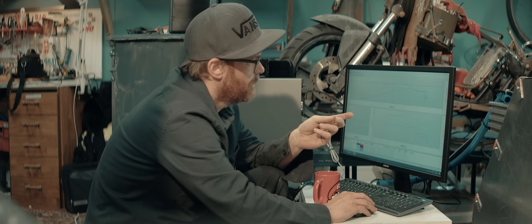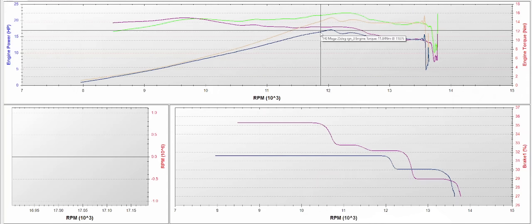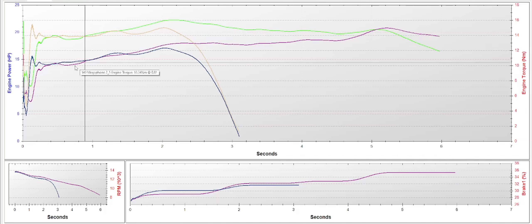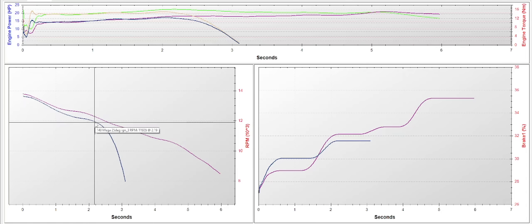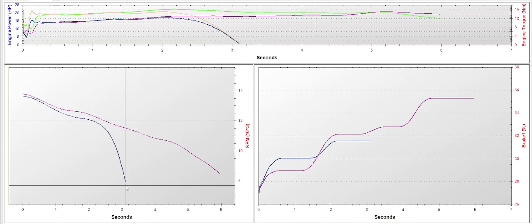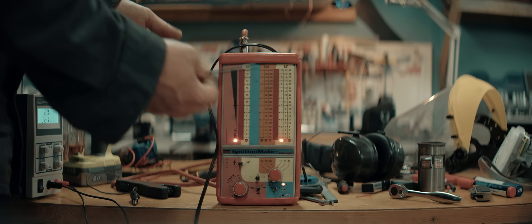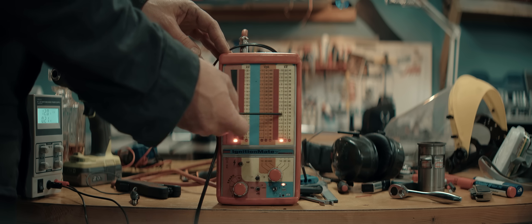Here's a comparison between the longer megaphone with 20 degrees of ignition timing and the longer megaphone with 25 degrees of ignition timing. You can see there's some weird stuff going on with the 25 degree ignition advance curve. This makes more sense when you look at the results versus time — both runs start off in a normal way, and then those 25 degree ignition advance curves just plummet at around two and a half seconds. For some strange reason after two seconds it just loses all power. I'm thinking this might be ignition related. We have a way to find out — you've seen my Ignition Mate before. With this we can monitor consistency of spark current and voltage while it's running.